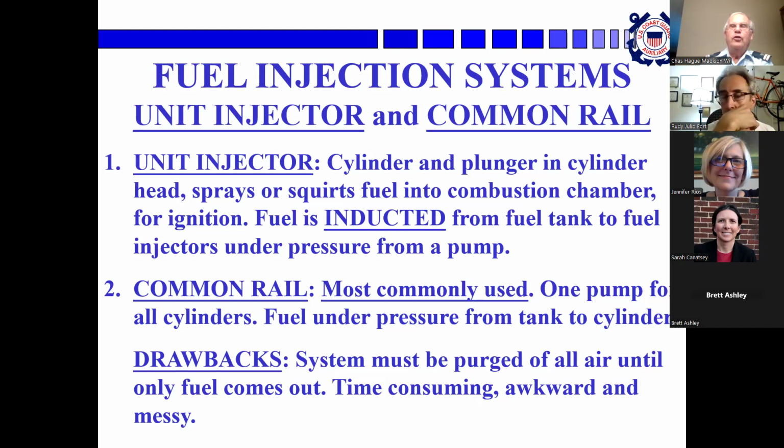A lot of gasoline engines now use a fuel injection system rather than a carburetor. You have a little tiny pump at the top of the cylinder. At just the right time in the cycle, it squirts a measured amount of fuel into the combustion chamber. When the diesel engine gets the squirt, the fuel ignites by itself just because it's so high pressure and hot in the top of the cylinder. The gasoline engine still has the spark plug, but the fuel is delivered by the little pump.